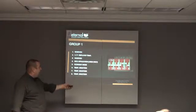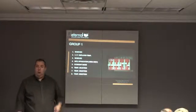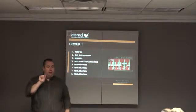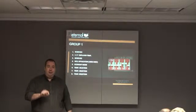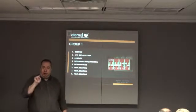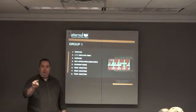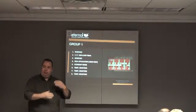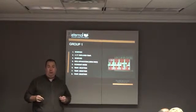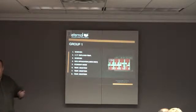Well, one more thing about the temperature control. If you happen to put this in an apartment building, let's say, they don't want people messing with the temperature, you can change the configuration of the dip switches and make it so they can't put it above that temperature. So like if I took number 7 and turned it off and left number 6 on, you could put it up to 120, but you couldn't put it past 120 no matter what you did to the button. And you can set every one of those temperatures up to 140 degrees so it can't go past that or won't come off that temperature, which is kind of a neat feature. So, yes, you can keep it so they can't change it.